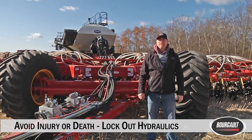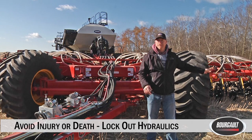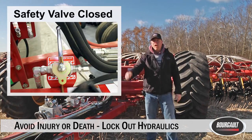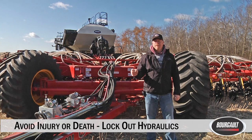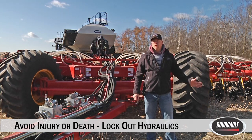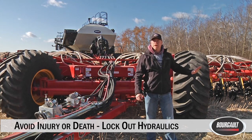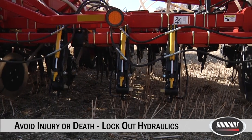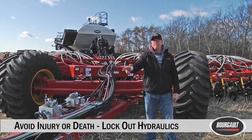On the startup checklist there's a safety operations section. If you're going to do any work underneath your drill, first shut off your opener hydraulics, shut down your tractor, and activate your safety valve — close the safety valve at the hitch. This is especially important on our 3330 and 3335 with the lift master option. Our openers and mid row banders raise and lower based on coverage, so if GPS sees a drift of one inch towards unseeded ground your openers can automatically drop. Make sure you shut off your hydraulics, shut off your tractor, and close your safety valve at the front of your hitch.